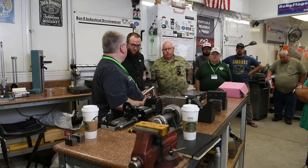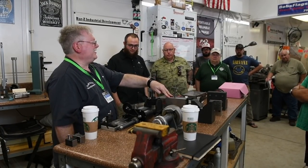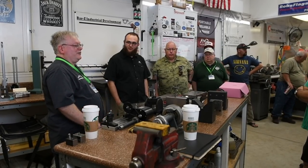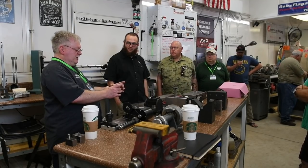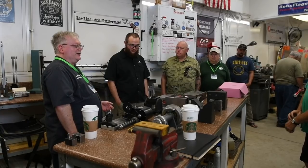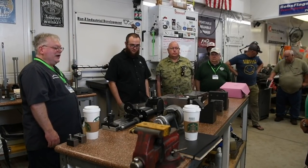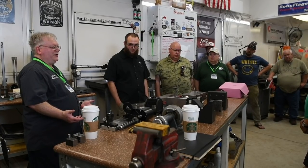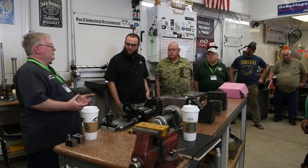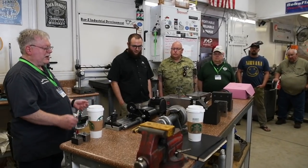The flatness and parallelism is only as good as the tools you use. When Stan showed me this unit I'd never used one, but I can instantly see the principles - that's what I use the tube for on all the surface grinding equipment I have. I've got a little toolmaker's device, a precision one that I didn't grind myself - some friends with a lot of surface grinding experience ground it up and it stayed good over the years. If you make your own, I'd recommend at least A2 as the minimum, but there's a new steel, DC53, that has the strength of O1 and wear resistance better than D2.